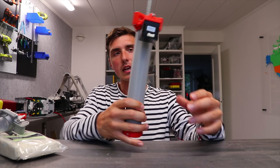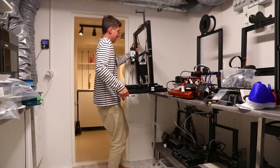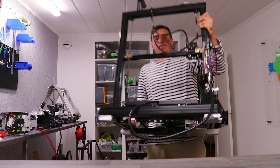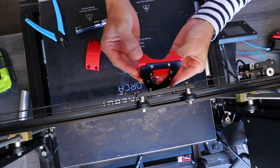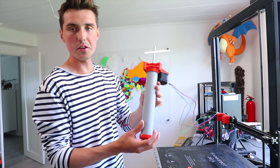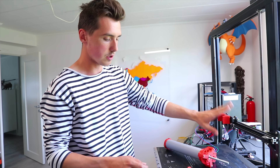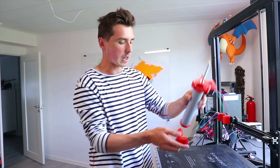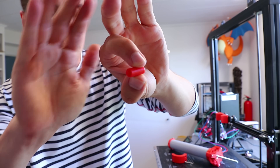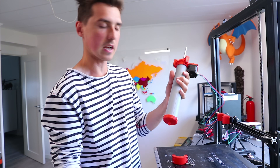We'll take this, put it through the printer and start making stuff. I chose to use this massive printer because I figured it would be the easiest way of mounting this huge thing. It also has a magnetic mounting plate for the extruder, which is really simple. So I just made a bracket mount — this just holds together with a clamp. I also took the liberty to print a small nozzle; it's a 1.5mm nozzle that just goes on the end of this extruder. Hopefully we'll be able to extrude some clay through this small nozzle. That's a little sketchy, but might work.